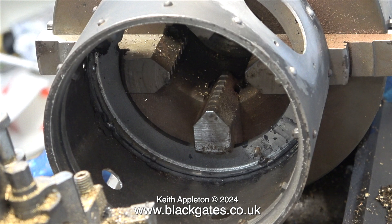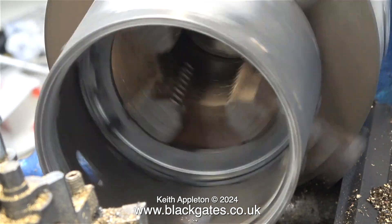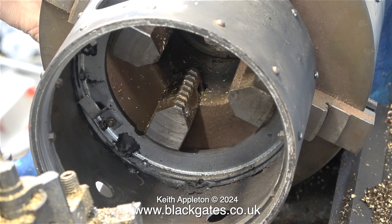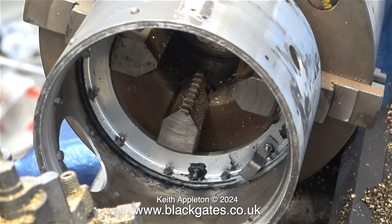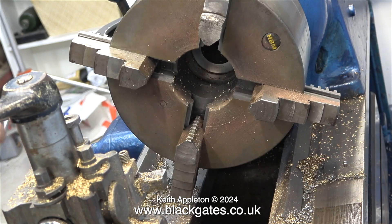These days when I make these videos I don't often use the biggest of my three lathes, which is an old Smart and Brown model 1024. The chuck is large enough to support the work from the inside, as you can see here, but it's running anything but true, so I need to hold the smoke box by the outside, which means I need to change the chuck jaws.